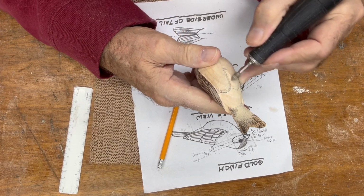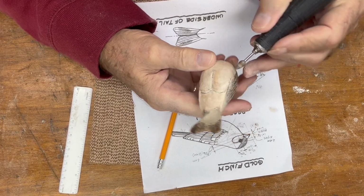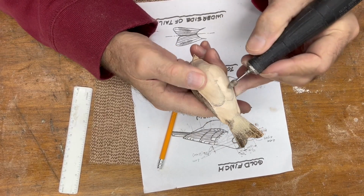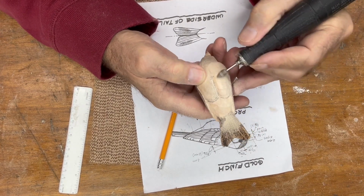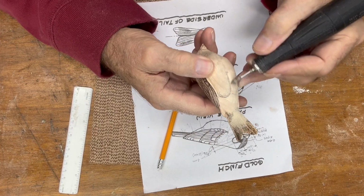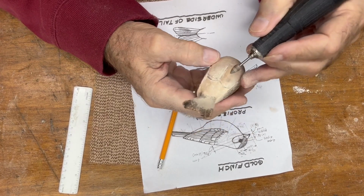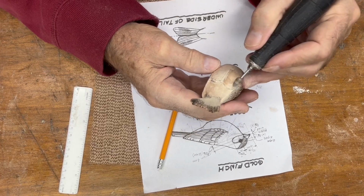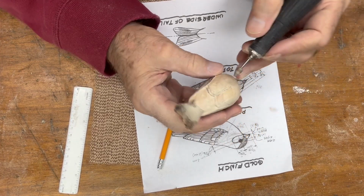I'm getting down to where it should be. Now I'm coming all the way around, and what I'm going to do is dome this area, okay? There'll be like a high spot here and a high spot over here, and this all blends away. So all this channel edge on this side and that side should get blended away, okay? Just like we did with this going this way.